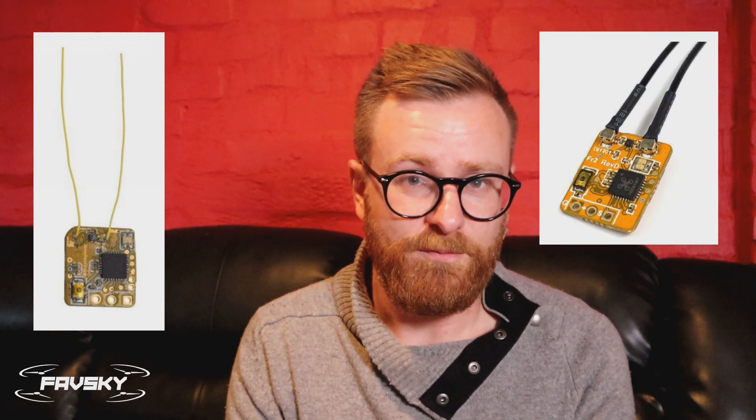Final thoughts on this receiver, having flown around with it a bit: it wasn't dramatically better in terms of signal than what you'd get out of a whoop anyway. It's got diversity, so there's probably a little better reception in congested indoor areas with interference, but it wasn't world-changing. You don't really need that much range out of a whoop. Probably my one gripe is the antennas — I wish they used more robust antennas like their other FlySky model. I did have to re-solder an antenna a couple of times, so I'd recommend putting a drop of hot glue on there to keep them secure, and then bend them about 90 degrees apart. But that's it — great little receiver, the tiniest one you'll find. NewbyDrone makes some really cool stuff.